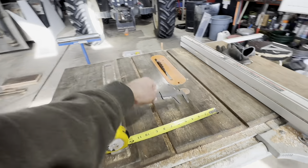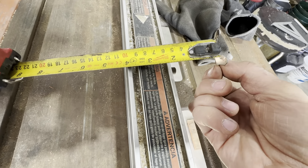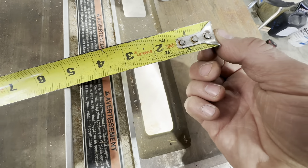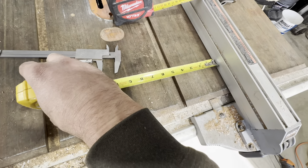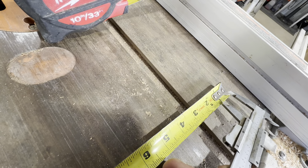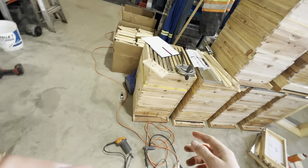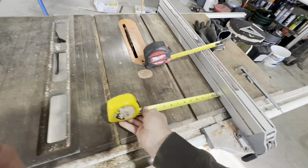When you pull out a tape measure, check to see - you see how tight I'm trying to move that back and forth - it's super tight on this one. This other one actually has probably a good sixteenth of an inch of slop. So most of my cuts I'm pushing that into the fence to the guide, and I've taken my calipers, set it on one inch, and checked to make sure that is actually one inch. Because when you're cutting these at nineteen and seven-eighths and you're trying to get them so there's not a whole bunch of gap, you want to be aware of these little tips and tricks.